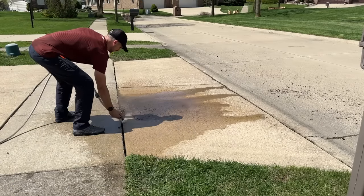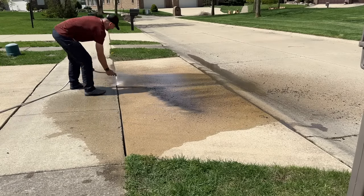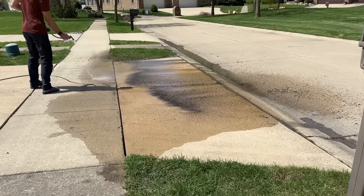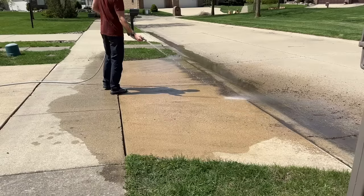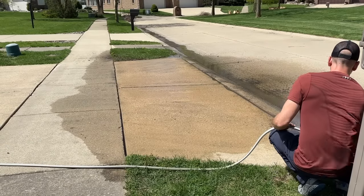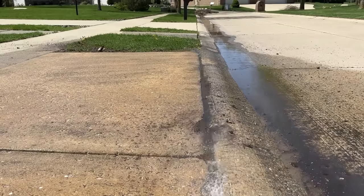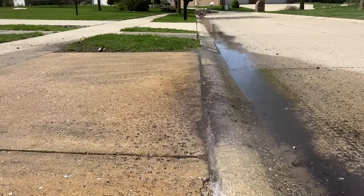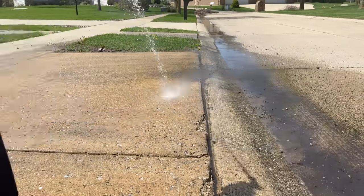To make sure we do not have that ideal scenario for weeds, go ahead and grab your garden hose and work your way down the expansion joint, shooting the stream right down the joint where you're able to get out quite a bit of that material — digging down a couple inches below the concrete surface. Start from your high side and work that dirt down to the low side, this low side being the street in this case. If you shoot that stream right down the expansion joint, kind of horizontally, you'll see it start to hit the hard surface of that packed soil. Do be careful because this can blow back at you and get you wet or muddy. Work your way slowly down and this will make quick work of all that dirt, debris, and soil, cleaning everything out.